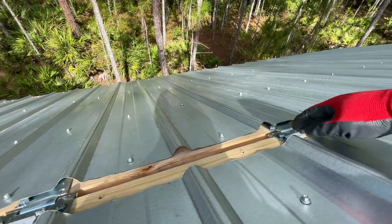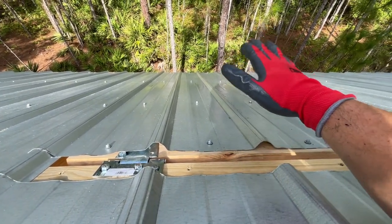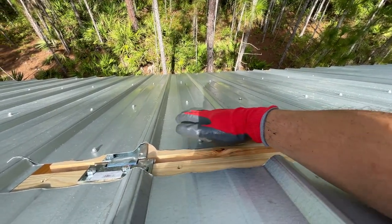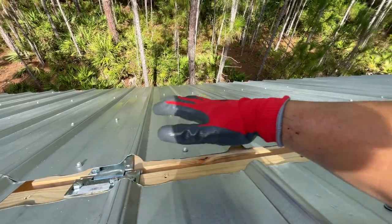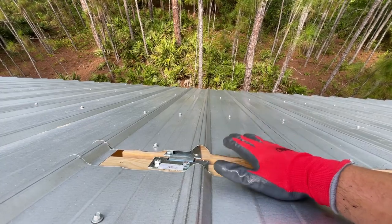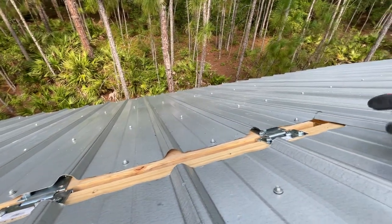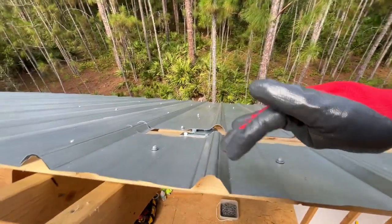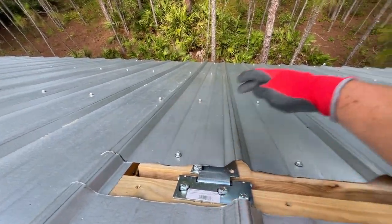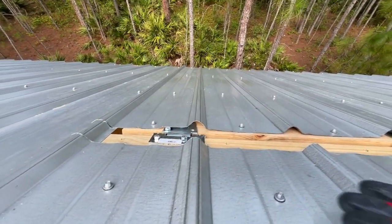Well, up here on top of the door, we have these hinges. We're going to sheathe over here with some flashing. So when the door opens and closes, the sheathing will go up and down like this, and it will let the water run down over the hinge area, the gap here. So it'll be nice and dry all up in this area. When you open the door, the sheathing will just kind of bend upwards slightly. It's not even bending that much, but just enough. I have some flashing we're going to put all along this section here. This side up here will tuck underneath the ridge cap, which will be right around here. And this will just screw into the tops of these ridges along the way, so that it keeps it nice and secure. If it's windy out, it won't go anywhere. And it'll get the water running straight down the roof.